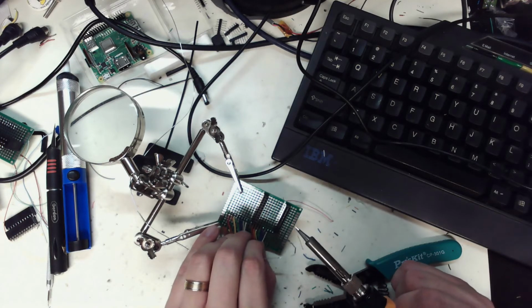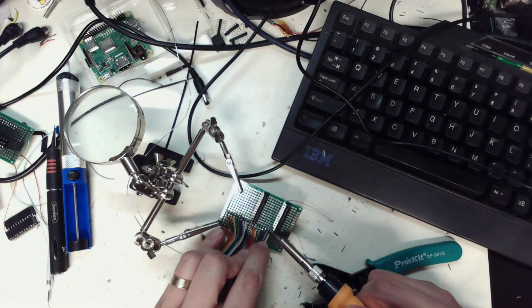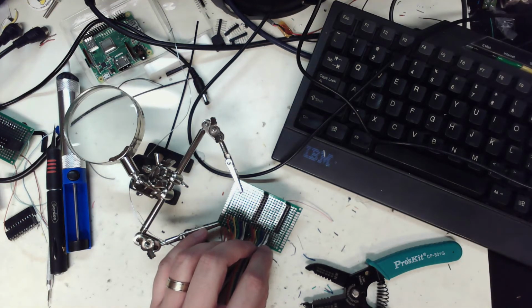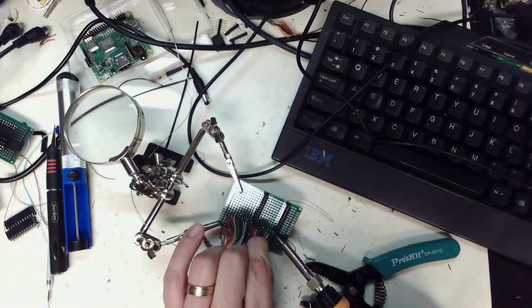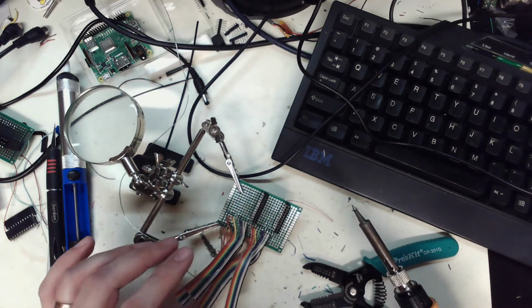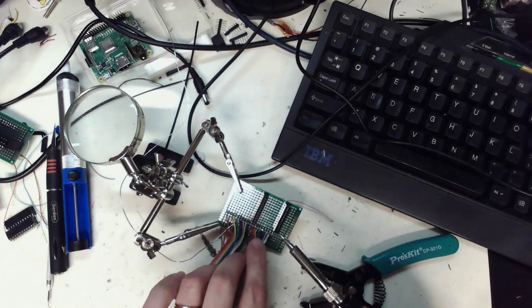So I also got the video capture set back up for the 5200. Actually, for all analog systems, so it works pretty well. Let's see, I'm going to switch scenes here. Up in the corner, I can use my HDMI capture card. Though my 5200's signal's a bit noisy, so I'm going to have to go in and see what's up with that. A lot noisier than it used to be, so something changed.